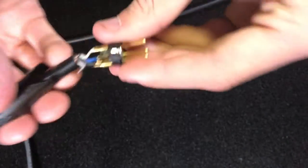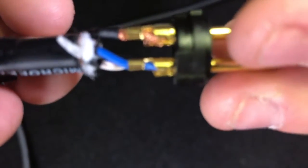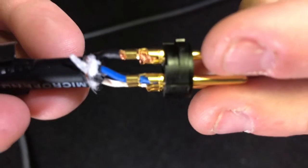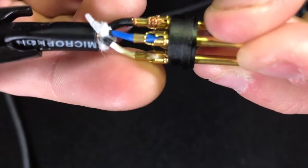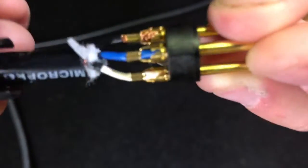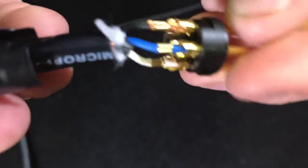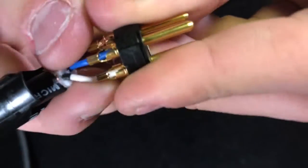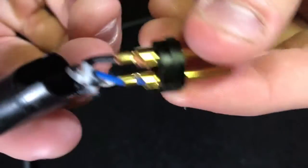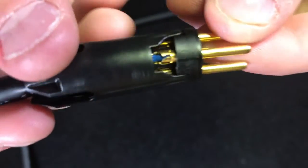Lastly, the Edge Series — this is the best you can get. The wire is a little more insulated, and you can see it's actually got a strain relief on every cable where it reaches the connector. They're also heat-wrapped and then soldered internally, so there's a lot less chance of this cable being broken from drops. There are two strain reliefs on each cable, so it's not like you're going to get one pin that goes wrong and stops working. This cable altogether is probably the best one you can get.